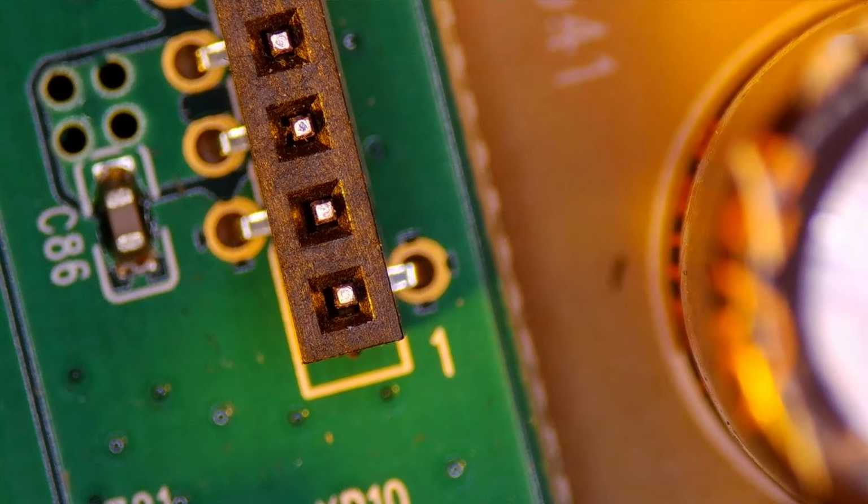Do we have any voltage here? Nope. What about here? We do not. So this might be our problem then. This is the point of the board where power comes in, hits here, and then distributes out to the board. So right away, we've already found an issue with no power going through the board.